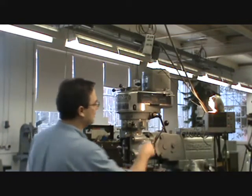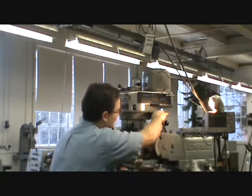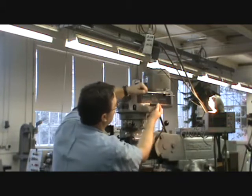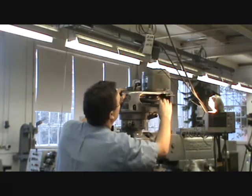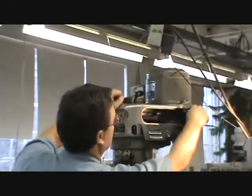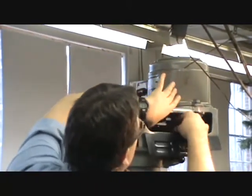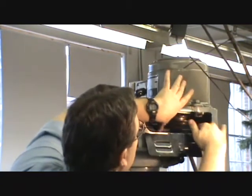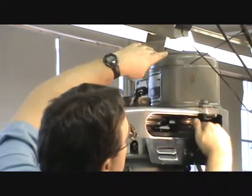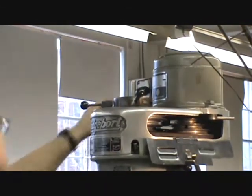Make sure you put this in low gear — take the two knobs and put them into back gear, turning the spindle slightly by hand if needed. The top knob has to go in with it — they're either both in or both out. Open the guard and set the belt on the fastest pulley speed, which is at the bottom. Loosen the motor clamp, drop down on the small end first, push in on the belt to engage with the pulley, then push on the motor and lock it.